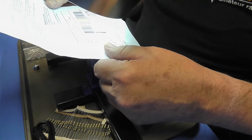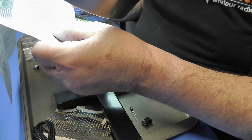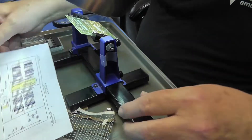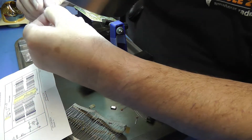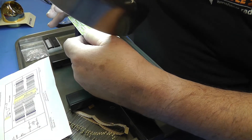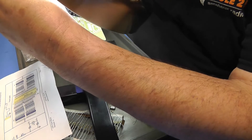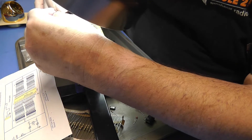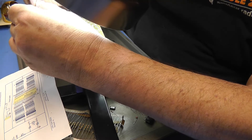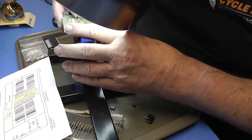C1 and C2, which are supposed to be 33 pF — but that's interesting because there are no 33 pF capacitors, only 22 pF capacitors. The instructions say 33 pF but the board is marked 22 picofarad. So the components are right according to the board — it appears to be an issue with the instructions. Be nice to get the instructions correct.